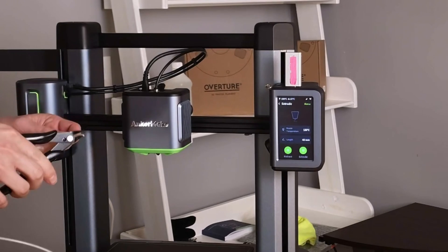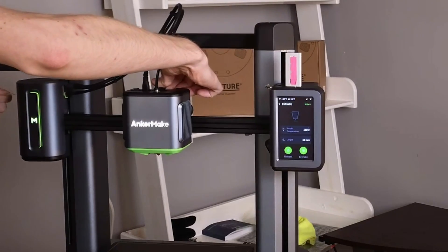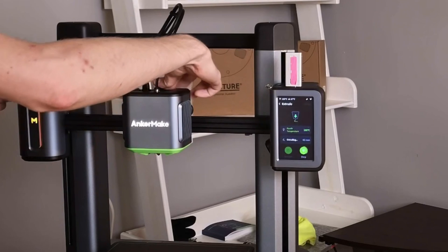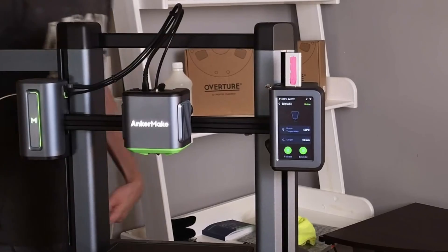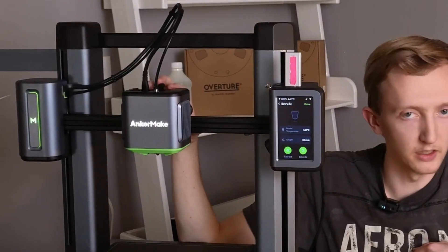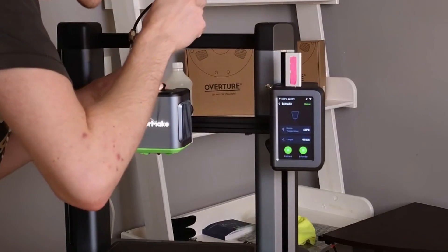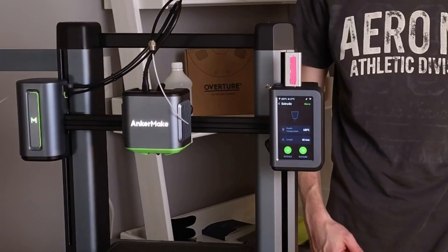Let's try cutting it again. The first time I did this it was super simple, and even earlier today it just took some jabbing. But now it's getting stuck at this lever — it's not getting past it. I don't know what it's getting stuck on. So I might have to do some taking apart, maybe look at doing something with the hot end. It's going in but then it just stops. I tried to shine a flashlight into it but I can't see anything. It kind of looks like there's some silk gray filament in there. So I'm going to take it apart, unfortunately.